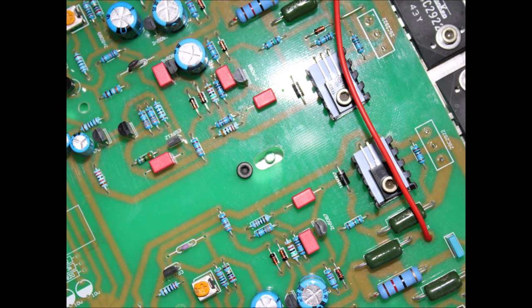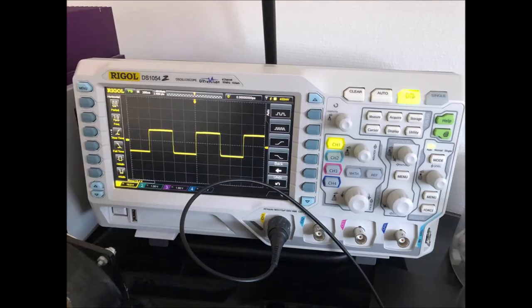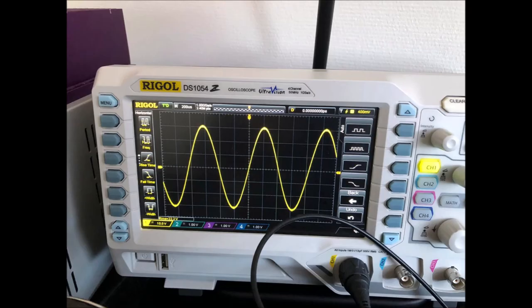I left out the power supply for the pre-amplifier that's originally built into the amplifier. However, the bare PCB has the option, and it's up to you if you want to populate that part or not. I decided not to go for tantalum capacitors. Tantalum capacitors have excellent characteristics, but when one goes short, it burns vigorously, and that probably results in a burned down or broken print. So most important are the coupling capacitors, and for that I put in very nice Fischer 10 microfarad capacitors.